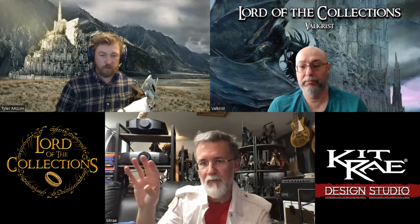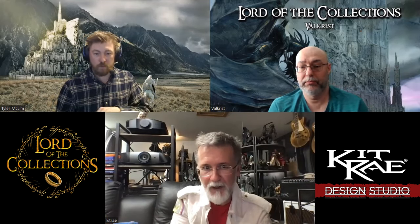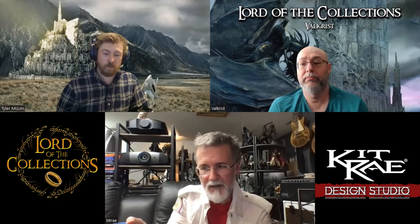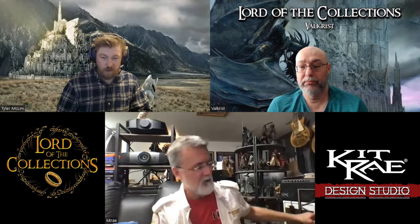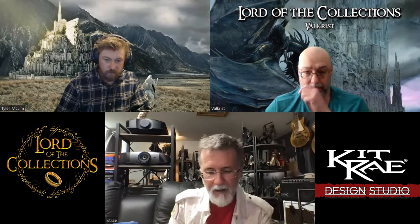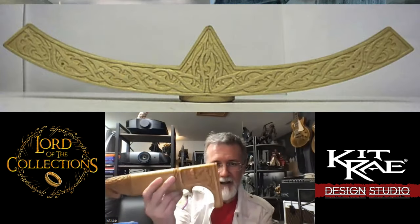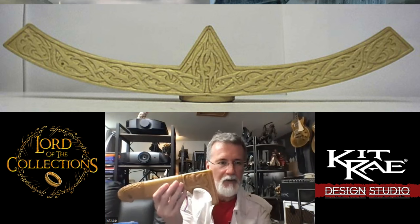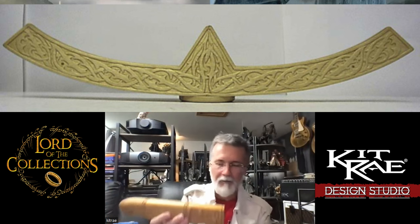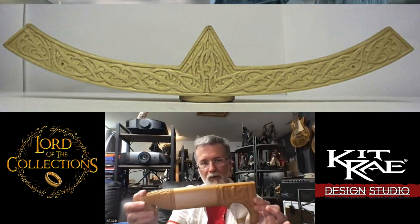We could find a company to print it for us, but we weren't even doing 3D CAD up until that point. So those first three or four Lord of the Rings swords, I'll show you what we were doing. Back then, if you wanted to make tooling for a handle, we would do a carving. Oh, yeah, very cool. Depending on the level of detail, it would be a 2x or 4x scale. But all those parts that were going to be cast in metal would start with a wood carving.